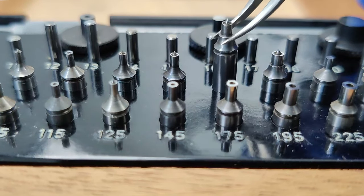Let's remove one meantime screw with this balance screw remover. And once the blade is in the timing screw slot, we'll release the prongs so that they grip the screw head. You'll notice the prior washer that was installed. The other meantime screw had three washers attached. And now we can slide the properly weighted timing washer down the screw's shaft. Okay, now we can exhale and screw the meantime screw back into the balance rim.